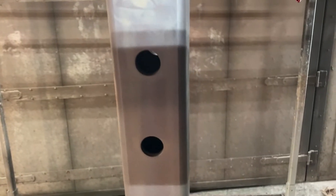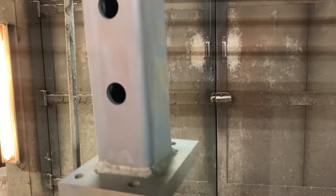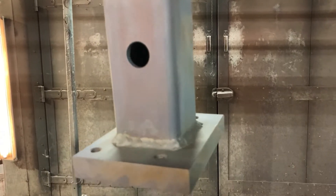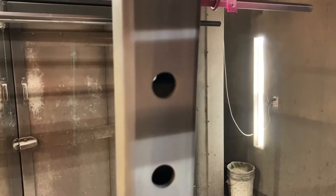The part is dry and has come out of the oven, still a little warm. Now the part has a bluish appearance that changes into some golds — that is the iron phosphate conversion coating. You don't always have to use iron phosphate; there are some new technologies out there like zirconium that's completely clear but still keeps a part from rusting. They're kind of a nanoscale product, but this is the proper way to clean a part — this part is clean.